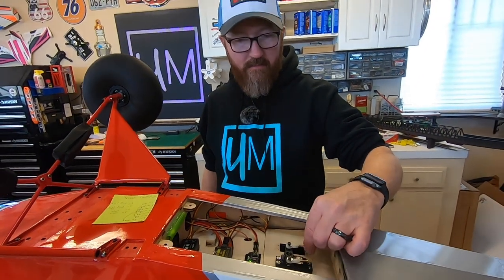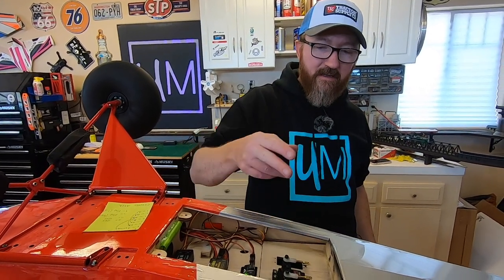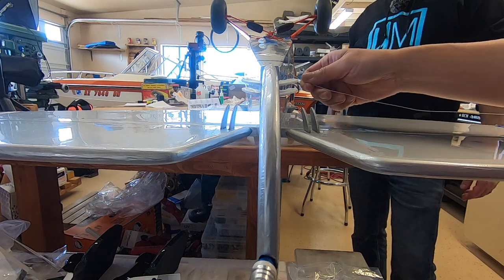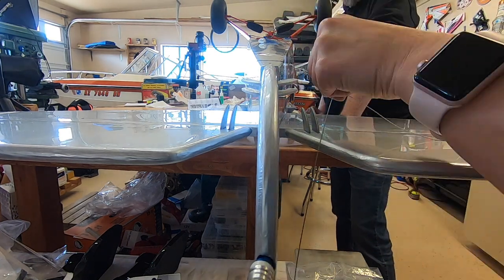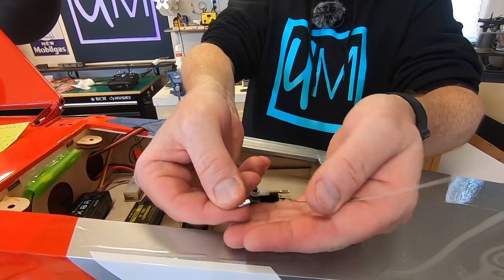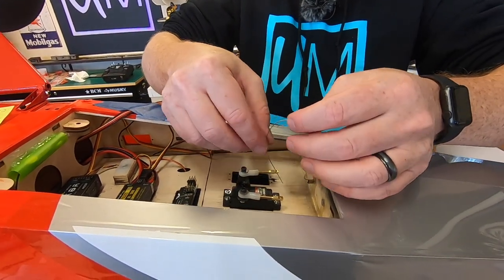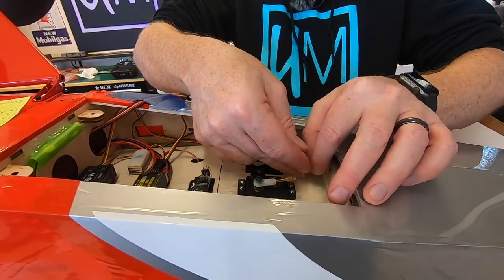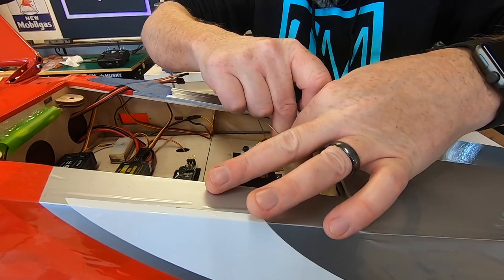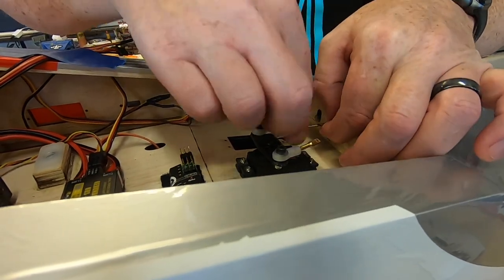What is next, Mary? Pull-pull! So we run some cables. We're going to run the cable loop through here and squeeze the clamp. We're going to feed the wire in through the back — that's what the directions say. All right, we got our wire through. Grab one of your barrel crimper connectors, slide it on first. We're going to run it through the side we're working on — the other end is going to go through the other side of the barrel connector. This is pretty fiddly stuff. Just take up some slack, pushing it down the fuselage to the other end.